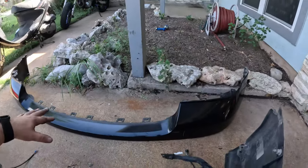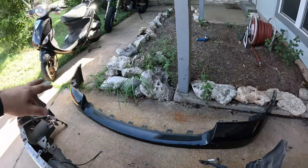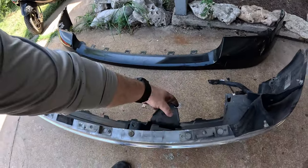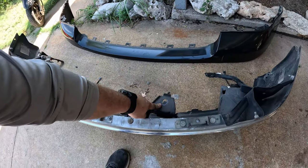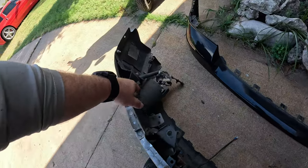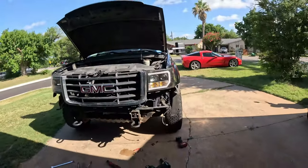There's nothing really to do except tear all this plastic off the truck and see what's lurking underneath. It took me about 30 minutes to get the front bumper off — really not too bad. This front mustache area has some 7mm screws on either side and a bunch of pop clips. The bumper has bumper mounts plus 21mm bolts that hold it on, and there are 15mm bolts that hold the little side pieces on. You also have to disconnect your fogs.